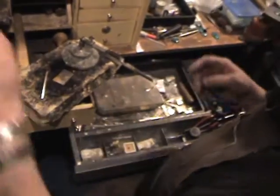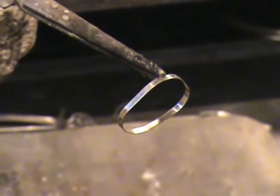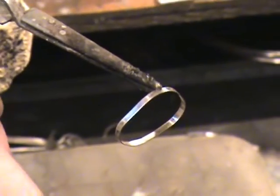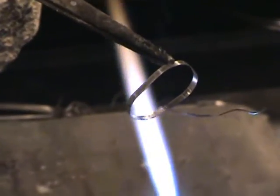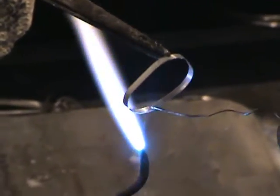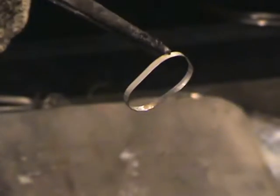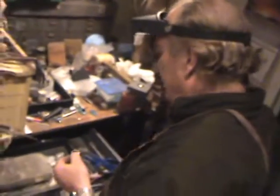Flux is your friend. It helps to have a good amount of flux on there because it helps the solder flow very easily across the piece. You don't need a very hot flame to do this. Put the bezel together — it's a very low flame — and put the solder right to the edge of the bezel, just barely touching the seam, only about a quarter of the way in. As soon as it melts, it's going to run down the seam just like that. Always heat your bezel from below to draw the solder down through it, because the solder will flow to where the heat is.